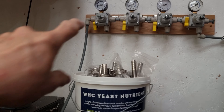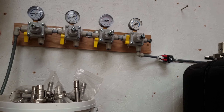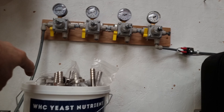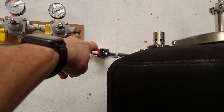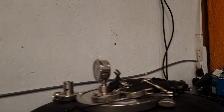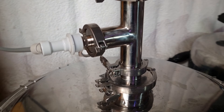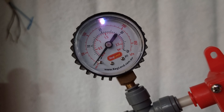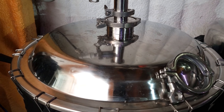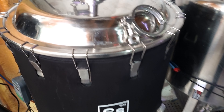I've brought this into commission. I've got some elbows - I could easily have just used little bits of pipe and normal elbows, but I wanted push-fit elbows just to keep it more tidy. So we've got gas coming in here, CO2 coming in here through these, and then out into that solenoid. It only needs a little bit of pressure - these would take an awful lot more pressure than people realize, but two to three PSI is fine for me.